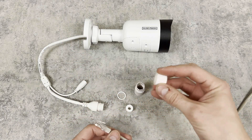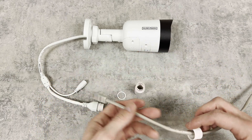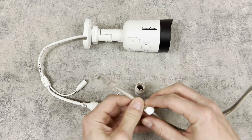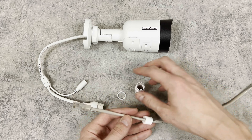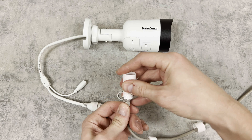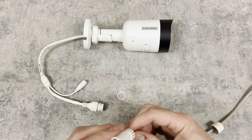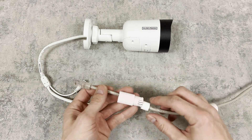Let's start off by putting the threaded compression fitting on the cable first. Next, we'll use this little tiny rubber fitting. Some of these have slits in them so they can fit over the cable, and some don't, so you might need to slice this in order to fit on your cable if it's a pre-made one like this. The last piece is just the other threaded end that'll complete the compression fitting. These can be a little tricky to fit on a pre-made cable, but once you do get the orientation right, they do slide right through.